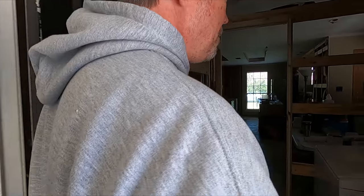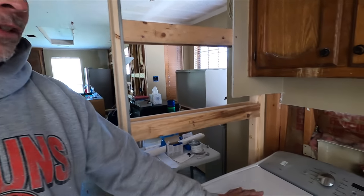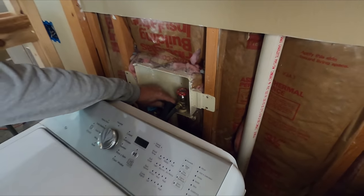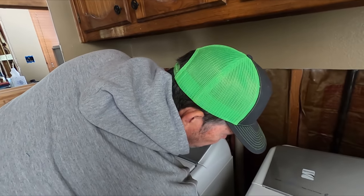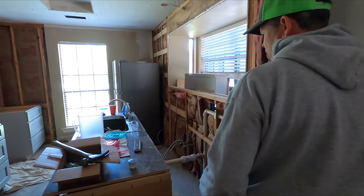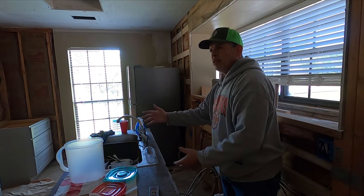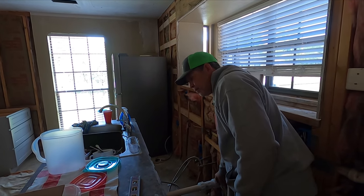The electricians are doing a great job. In addition, this week we got the plumber showing up — he promised he'd be here by the end of the week. The reason I need a plumber is because of this washing machine drain. This standpipe drain goes into inch-and-a-half pipe; my inspector is going to want to see two-inch right here. In Baton Rouge they make us upgrade and change it to two-inch pipe with a two-inch trap into the two-inch drain in the floor. While the plumber's here we also need to check the kitchen sink drain, because when we change from a six-inch deep double-bowl sink to a single-bowl farm sink which is ten inches deep, we could have an issue with the drain being too high.